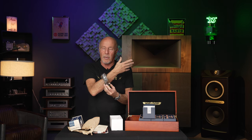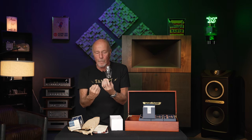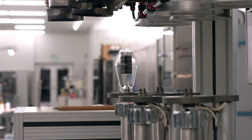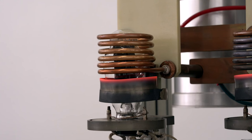I probably have 100 or 200 of those Svetlana tubes in the back, but one in four may fail. With the old diffusion pumps, you didn't get the highest vacuum. Now with the turbo molecular pump, it's all about giving this tube a really, really good vacuum. They also improved the plate by adding a one-micron coating of carbon — the material is called graphene. I'll be going to the factory soon and will get a more detailed explanation then.